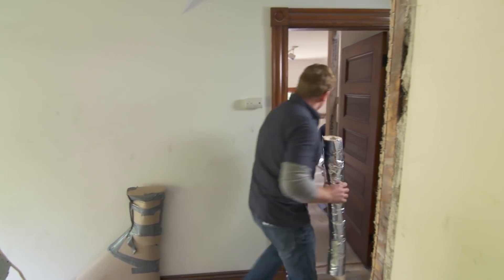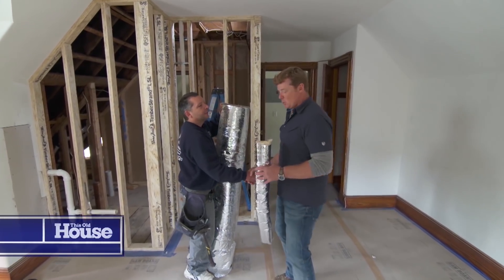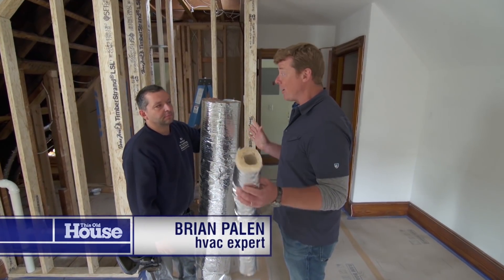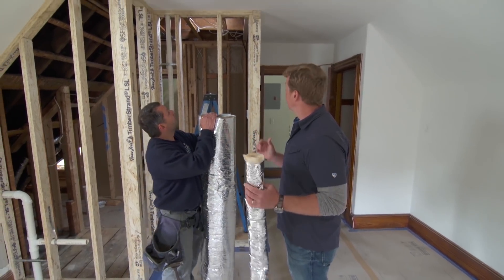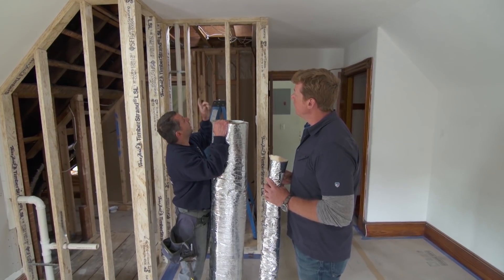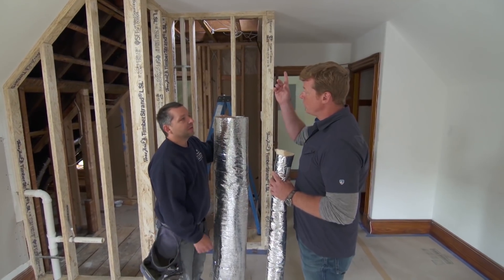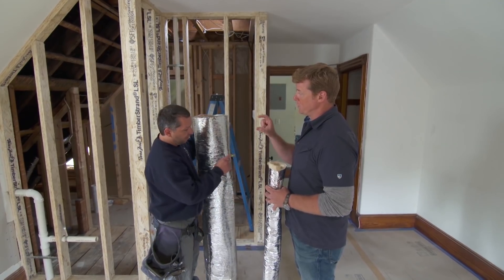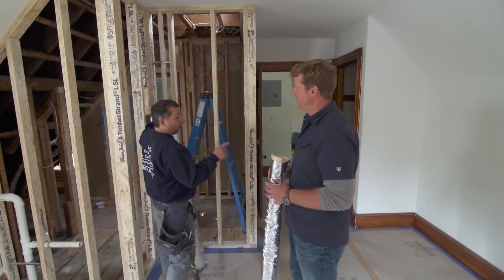The guy solving that puzzle is Brian Palin. Somewhere in the system we've got these small flexible ducts, but we also have air handlers at the head of the system. One is going to be in the attic and one is going to be in the basement — both very easy to access. The attic one services the third floor, the basement one services the first floor. So we're missing the middle floor — that's the difficult one, and it has to go in the knee wall.